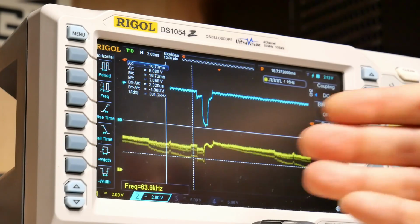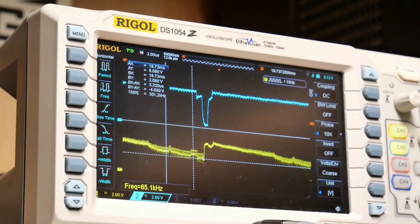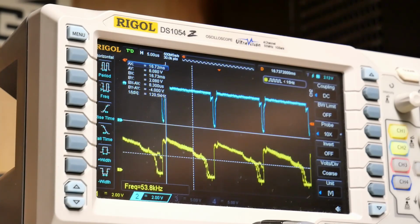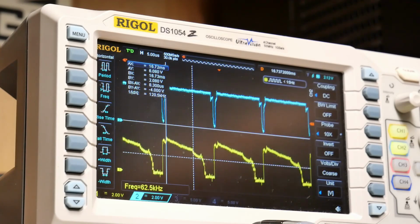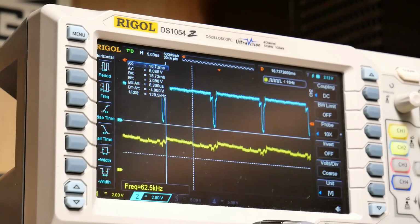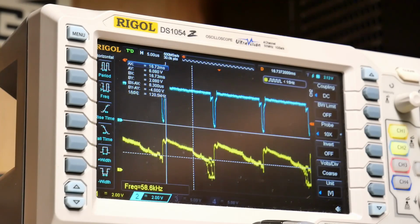Like if I don't touch it, it's moving back and forth, and when I do touch it, it's moving back and forth. I don't think this is a problem on the PCB. As it changes here, as you watch it change, it doesn't seem to coincide to anything I'm actually doing physically to the board. I'm just going to try one more thing, and I'm going to reflow the solder on every pin of the CPU from the backside, see if that changes anything here.